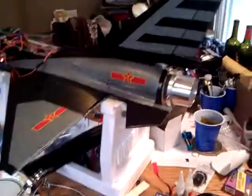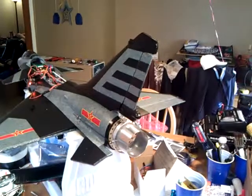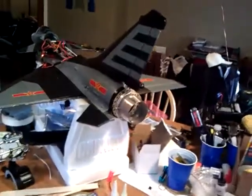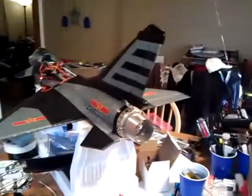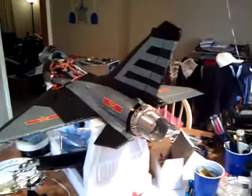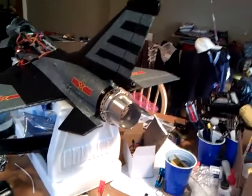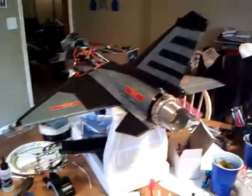After I clean up the wires, I'm going to put my new servos in and put my new hinges in. I still have to cut that control surface off over there. Then I'm going to start on the afterburner lights — I'm going to have three rows: blue, white, and red, wrapped all the way around inside. Those are going to be running off a separate brushed speed control so they'll have plenty of juice, but it will be tied in with my throttle. As I increase my throttle, they'll go from off at dead throttle to 100% brightness at full throttle. Those are also going to be tied into my flap switch. I may put that into the mix switch though, because there might be times I want the lights and not the vector, or the vector and not the lights. So I might find a different switch.